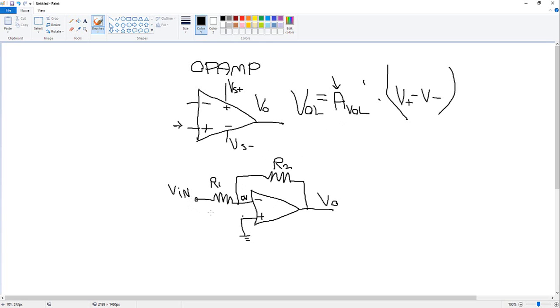Knowing this, we can calculate the V-output correlation to the input. The current will flow from V-in — let's say this is positive — directly to ground. Another key thing we need to remember is that the input impedance of the op-amp is very high, meaning there is no current flowing into the inside of the op-amp. So the current cannot go into the op-amp; it can only flow through the resistors.